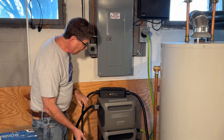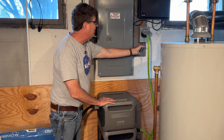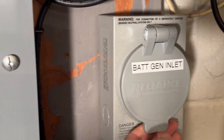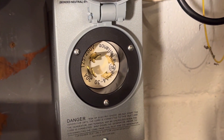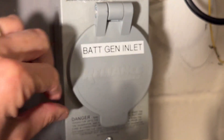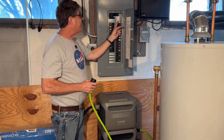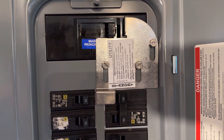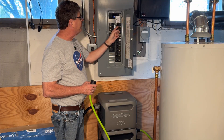The second thing they did was they removed the six-circuit transfer box here and put a straight battery or generator inlet here. Now this connects to the 240-volt output of the Anker. Everything's inside, I don't have to run anything outside, and then this goes right in. The last thing they did was put this transfer switch interlock, so you can only have this breaker — which is battery or generator power — or the main breaker. You can never have both. You have to throw the main breaker, slide this up, then you can throw this breaker, which energizes the panel.